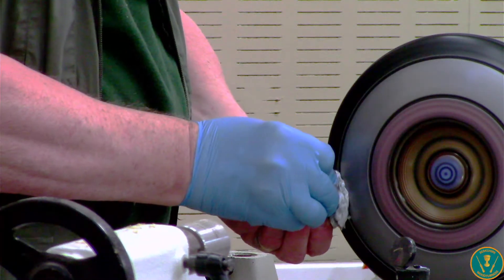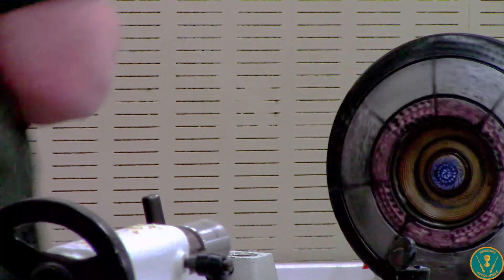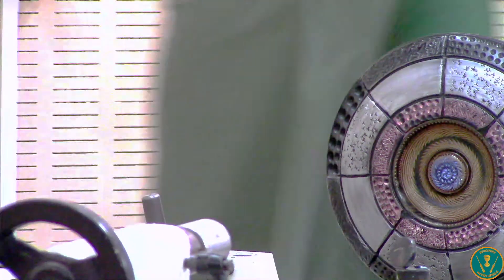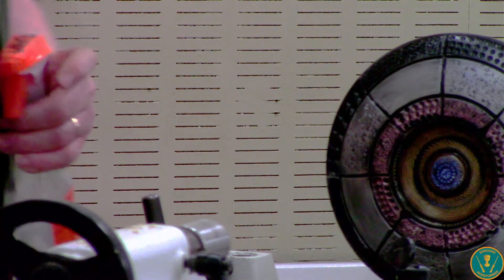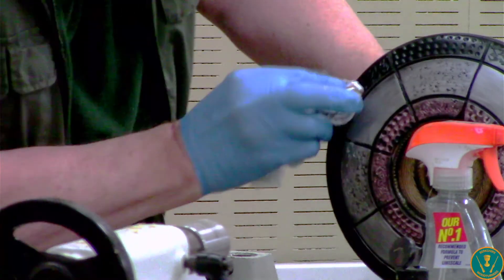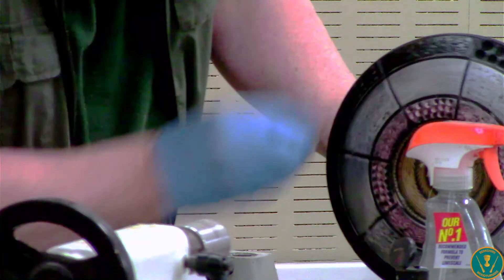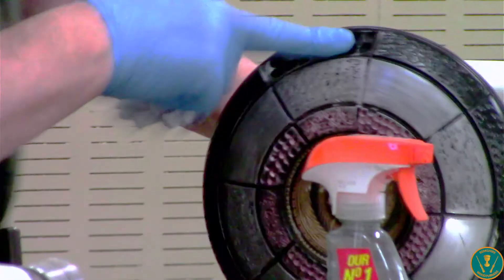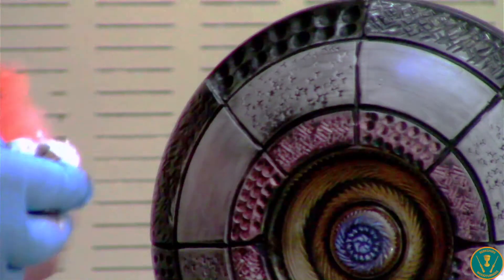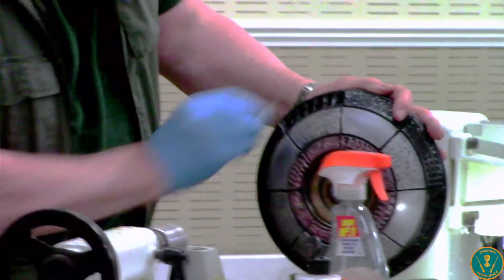I also find you can mobilise it again with a squirt of water. Always reuse your Mr Muscle spray bottle. A little squirt of water allows you to dress off anything that's in the way. If it's acrylic and the base layer of ebonising has been allowed to go off, then you can usually get it off. I can always put some more on off my glove and a bit of black just to tidy it up. So my colouring — there's no rhyme or reason to be honest, it's just whatever seems to look right. And here endeth the lesson for today.